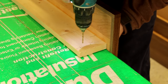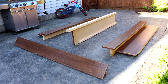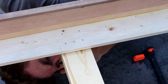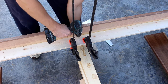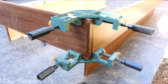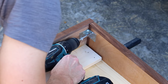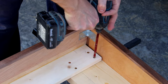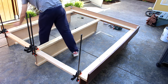I measure and pre-drill all my holes to avoid splitting and aid in reassembly. I chose to fit and assemble everything first outside my shop, close to my tools. I first mounted the front assembly to the main center I-beam. Having a large square during these steps is pretty crucial. I used corner clamps to hold the corners nice and square so I could pre-drill and mount the angle brackets. After the sides have been mounted, use a tape and measure across the diagonals to make sure they are the same — this will ensure your frame is square.